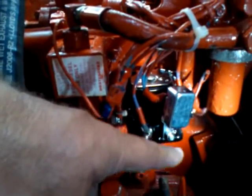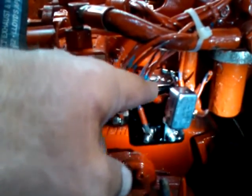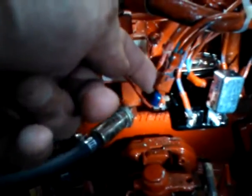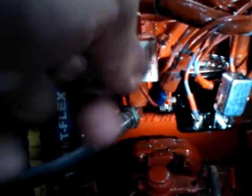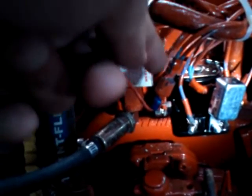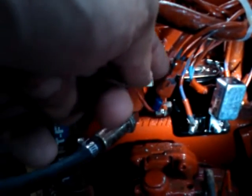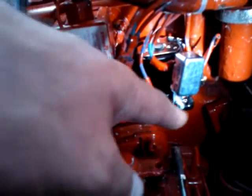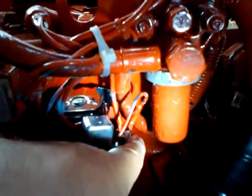Here's the I output — the second one over. I goes out through the 10 amp breaker and up this lead to the connection for the fuel pump, so this lead feeds right into the fuel pump. You'll notice there's two wires on this: one comes from the alternator, so once the engine is started, power comes down one of these leads and runs the fuel pump off the alternator. But when we're starting it, we've got to provide power from this solenoid. The fuel pump power goes up to the 10 amp breaker and into the fuel pump — so this is the I output of the solenoid.